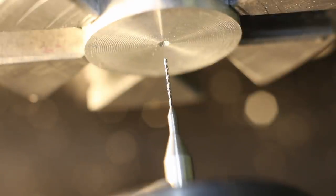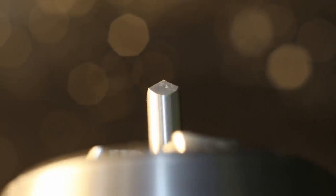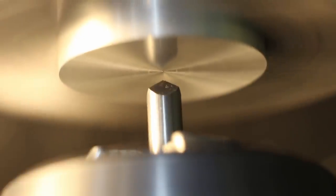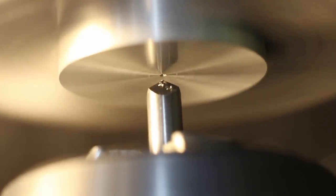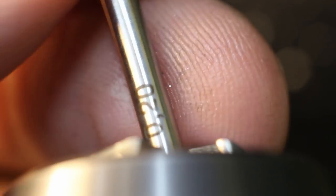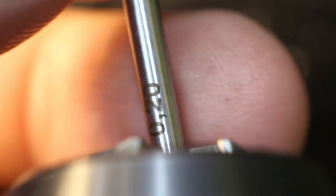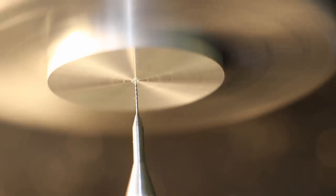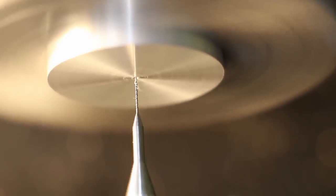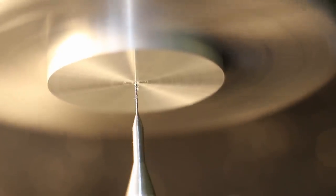Let's do another example with an even smaller drill. We use again the pyramid-shaped spotting drill to put a tiny spot point on the face of the workpiece. It's too big for the drill we're going to use but this is just an example. The drill we're using is 0.2mm diameter - 200 microns. Right at the entry you saw the drill bit vibrate a little bit. I've seen that effect very often but I'm not entirely sure where it comes from - it might be from mismatch of the tip angle. But as you can see, even with a 0.2mm drill, drilling with the carriage is absolutely a viable option.